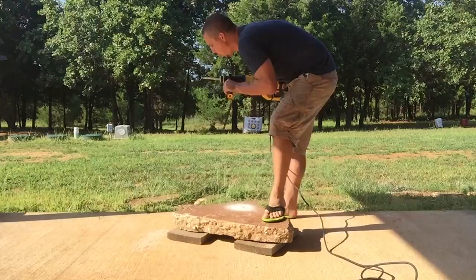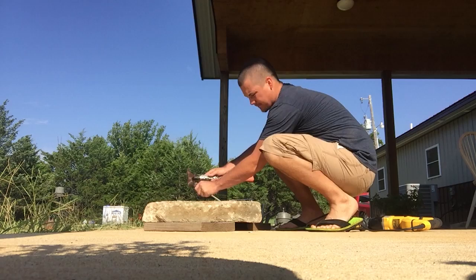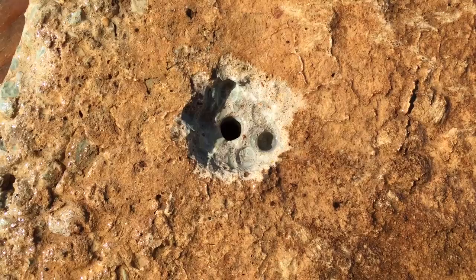On the bottom of the post I had to kind of wallow out the bottom so my washer and the head of my bolt would go in there and sit flush with the ground. Here I am chipping away — I actually drilled several holes around the initial hole. Here's the finished product, and here's a shot of it after I cleaned it up a bit.